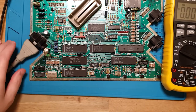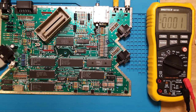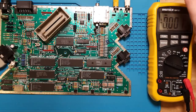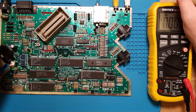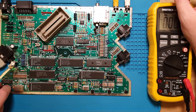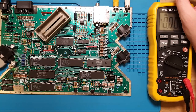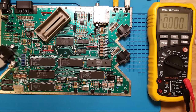I'm just kind of curious as to why it's not showing anything at all. Normally when that happens you get a red screen like I noted, but I guess if it is actually shorting and sinking too much current as heat and the rest of the chips and whatnot don't have enough voltage to continue, that would obviously cause that kind of brown out.